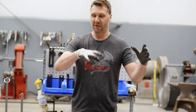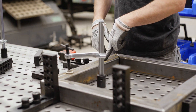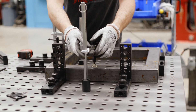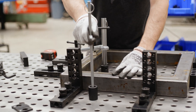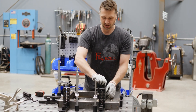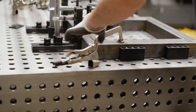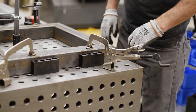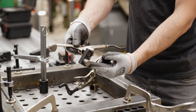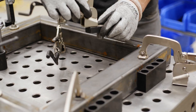Let's put our parts in. We have all these components and now we need to hold them down. We have a couple of choices — we can choose the vertical clamps. I always suggest two clamps on every tube. This is going to start adding up really fast. You can probably get away with one clamp, but I always recommend two — no such thing as too many clamps if we want this done textbook-like. Two clamps distributes the load more evenly and prevents slipping. Some of these clamps have swivel bases, so I'm able to choose a hole that's a little closer or further apart and pick the hole I want.